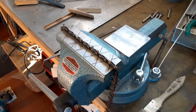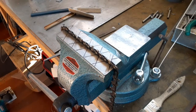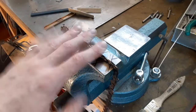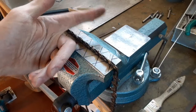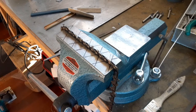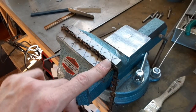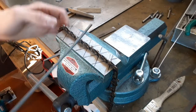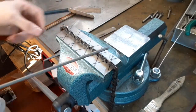Usually the chainsaw is being used when I need to sharpen a chain, or it's in the barn and I don't want to walk out there. I just get a chain like this and I need to sharpen it. So I've been clamping it in my vise, and you see these lines at 60 degrees from parallel. And I use that. You can see this chain doesn't have much life left. This might be the last sharpening. But this I like better because the chain is held really securely, so it doesn't chatter.